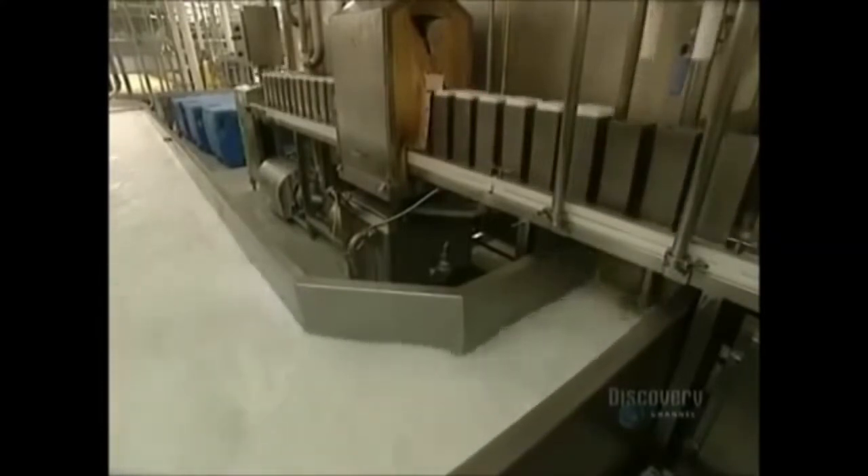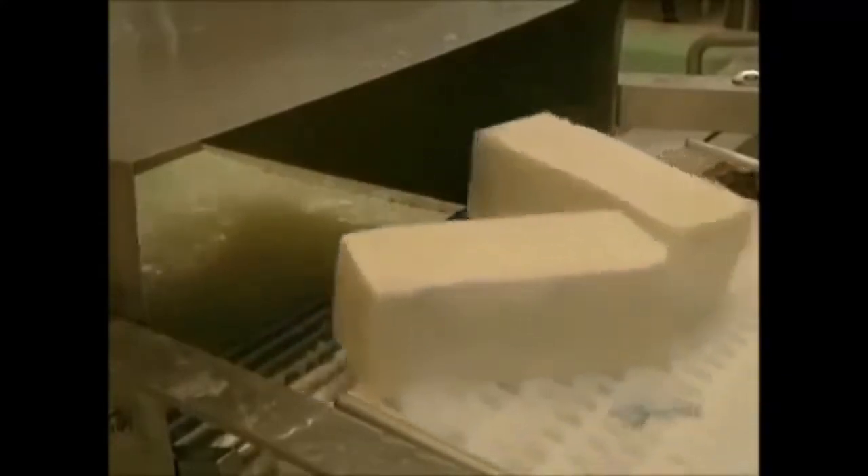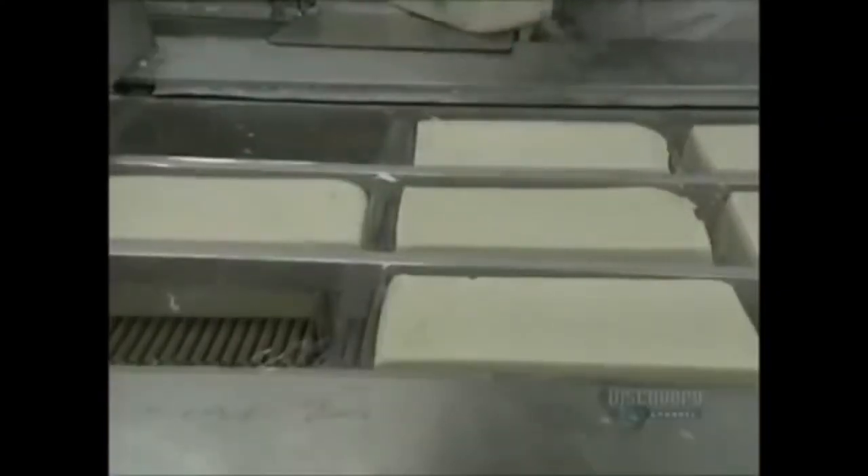Brine, a salt solution, serves to cool as well as to salt the cheese blocks. The blocks are unmolded and fall into a brine tank. The cheese blocks will then remain in another brine solution for a while. They are carried by a conveyor towards another tank, where they will be immersed for 4 to 10 hours at a temperature of 2 degrees centigrade. Sprays of brine remove the foam which forms at the surface of the tank. The 30,000 liters of milk that came in by truck at the beginning have enabled them to produce some 1,400 blocks of cheese in only 8 to 12 hours.